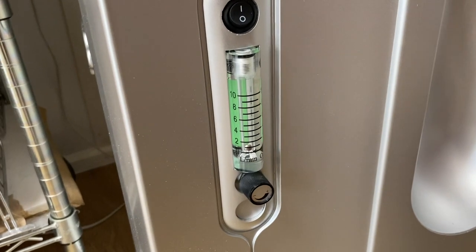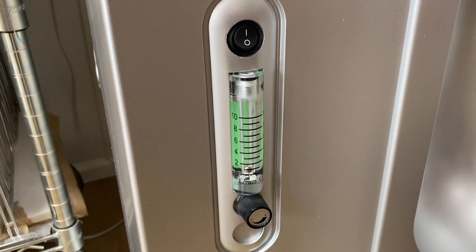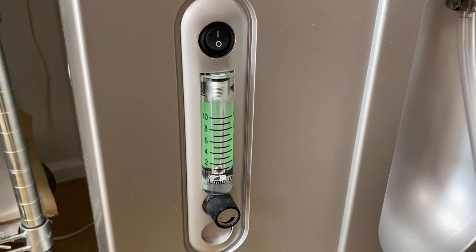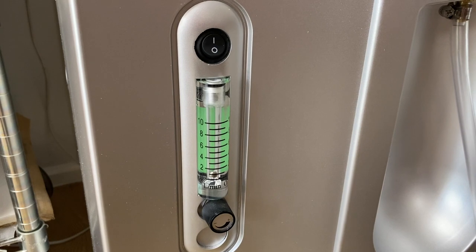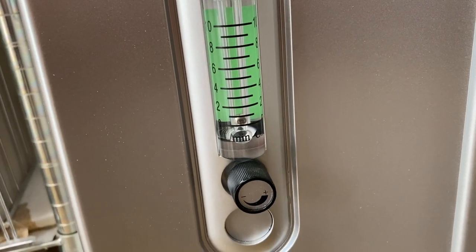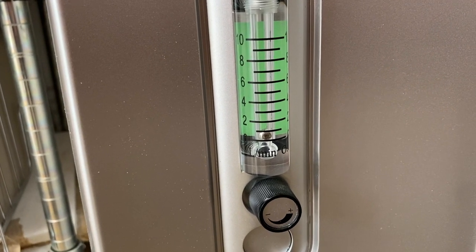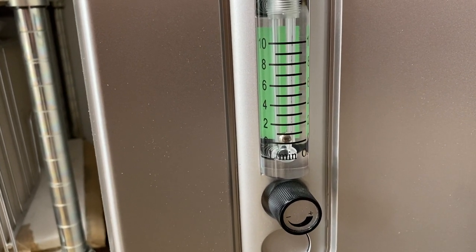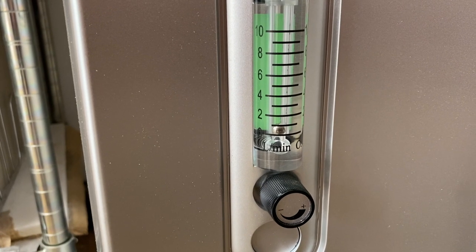Interesting then. So we read that wrong, which is probably stupidity on our part. Well, yeah, but the way that's possibly written, maybe. No, it's fine. So it actually says turn the machine on after the machine is warmed up approximately 30 seconds with the torch shut, which it is. The black ball will hover at zero. So I'm guessing all the popping and sighing is a standard thing, because that's hovering at zero. If the black ball is between 1 and 2, then you'll have a leak. So we don't have a leak because it's hovering at zero, which is perfect. So we've got oxygen then. The propane's turned on, and so the next thing is we're going to light the torch.